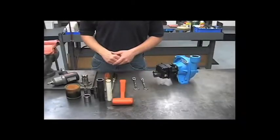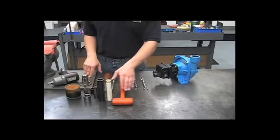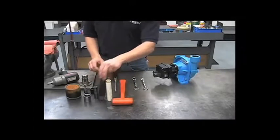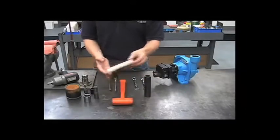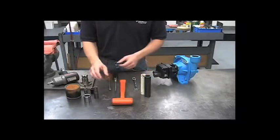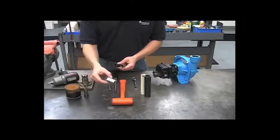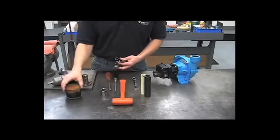The tools required to work on this pump are a 1/2 inch wrench, a 9/16 wrench, a rubber hammer, two flat screwdrivers, a piece of metal pipe that's an inch ID by at least 4 inches long, a 1 inch PVC pipe, a 9/16 socket, a 5/8 socket, an inch and 1/16 socket, a 1/4 inch Allen wrench, and some hydraulic oil.